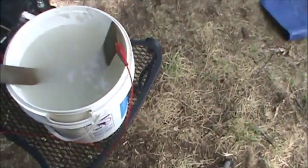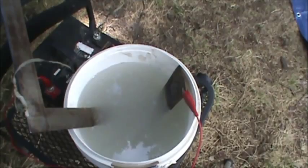It's already starting to go — this actually happens pretty quick. Excuse my bad camera work, I don't have a dolly. You can see along the edge there, that's it doing its thing. Whatever you use as one of the electrodes, one of them is sacrificial — this piece over here will turn into a big greasy mess. A lot of guys go to the home center and buy pieces of rebar — that works fine.